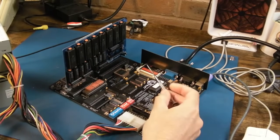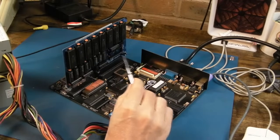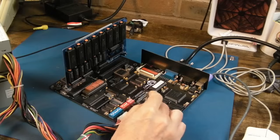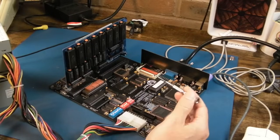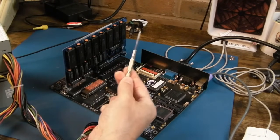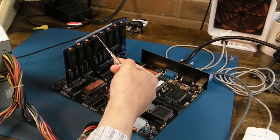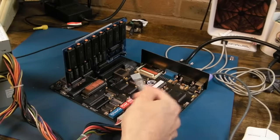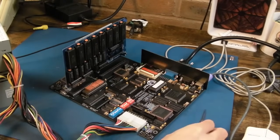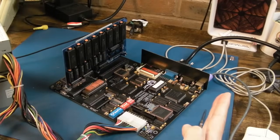But coming back, a sidetrack there, to the incompatibility with the driver, the UMBS driver. In order to use this with that 96K there, that clashes with this, but it seems to clash with the upper 2 meg, and it's 4 meg. So actually, if you got one of the original 2 meg cards, you'd probably find you wouldn't have a clash. I'm not really sure why we're getting that clash on the additional 2 meg, but it is. I tested it a few times, and the first 2 meg check out right, the second 2 don't.